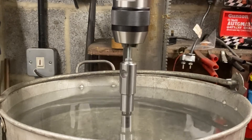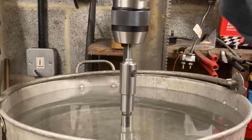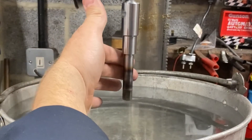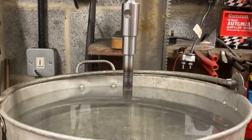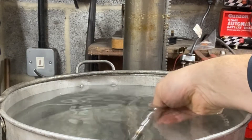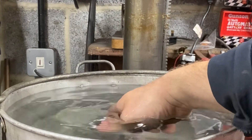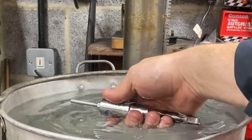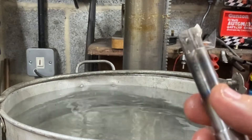Torch is off and the item is quenching nicely. That should be cool enough to touch now. We'll turn it off and immerse the whole thing completely to get rid of all the residual heat — remembering this is still warm water. The whole thing is now just at the temperature of the warm water. Give it a quick wipe off and see how hard the end has got.